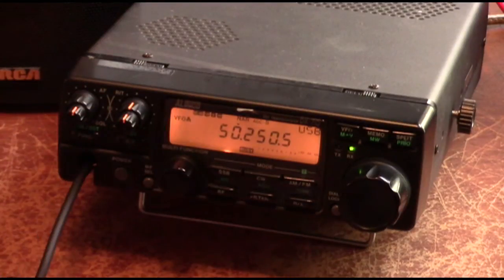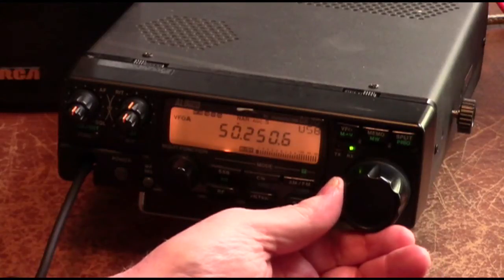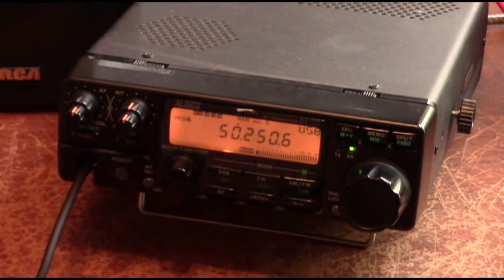Okay, we're out here with the Alenco and I'm going to find out how the Swan sounds over the air. We have signal — it's a pretty decent signal — but the Swan definitely drifts. You went from being clear on 250.4 to now clear on 250.6. So we're definitely going to have to work on the drifting problem. But the fact that we do have good, fairly clean audio now — that's a big step forward. You're clear as a bell right now; you didn't drift one iota, you stayed right on frequency.